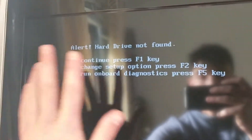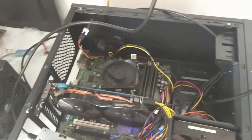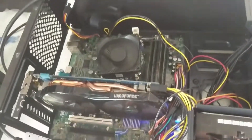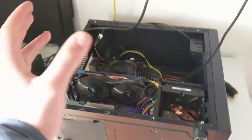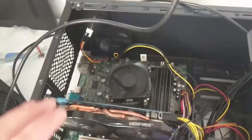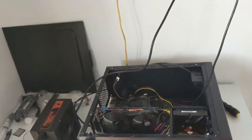So 990 right there. And then you can see: alert, hard drive not found. That is it — that is all that we have. That's the only error. Out of a couple of mods, that's all it takes to fix the issues. As for adapters, the only adapters needed are the fan adapter and the power switch. Unfortunately, with this motherboard you probably won't have front I/O, but this solution is pretty clean. If you look at it, you will not know that those mods have been done. So thank you very much, I hope you enjoyed it, and I'll catch you next time.